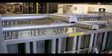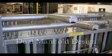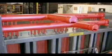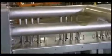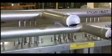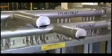The MV coil uses two distinct circuits in combination with the traditional face and bypass dampers. The circuits are now split 55-45, with four columns of coils followed by a second row with three columns. Wing has long offered two and even three row coil arrangements. The MV uses two manifolds, allowing complete shutoff of the second row of tubes during mild weather or under low heating demand conditions sometimes found in VAV systems.